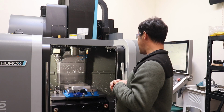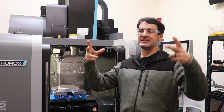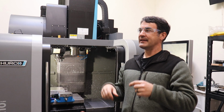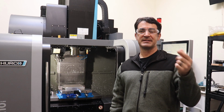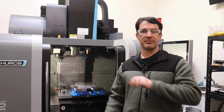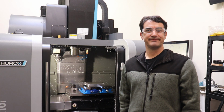And so now I am machining the aluminum base that the reference steel plate will key into with dowel pins, and then also hold all of the smaller A2 tool steel mold inserts, where each insert has its own cavity, for a total of 10 parts per mold half. And yeah, so hopefully you enjoy.